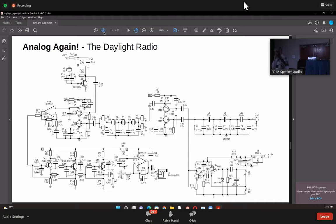Okay, and this is more than 30 dB down, the IMD, if you see here. It's pretty well done. It's really impressive for two chips, NE612s, which cost about $1 each. I'll just go back here.